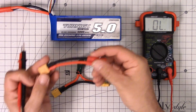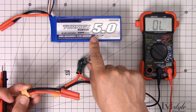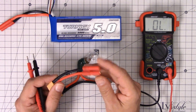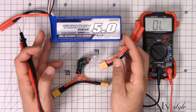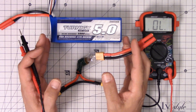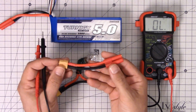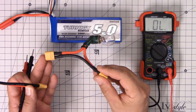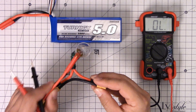I've just finished making this charging adapter for this huge 5 amp hour 5S battery, and before I plug it in I'm going to do some basic safety checks. I don't want it to have a short and short this battery. If you think a 1300 battery is scary — if this thing goes off, I'm going to have a really bad day. I'm also going to show you the same thing for my smoke stopper bulb in a minute.